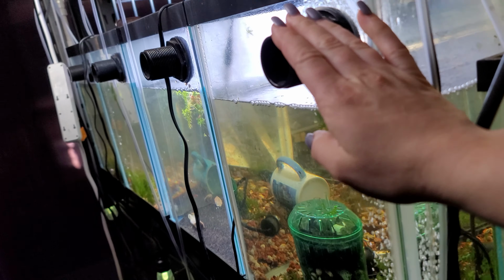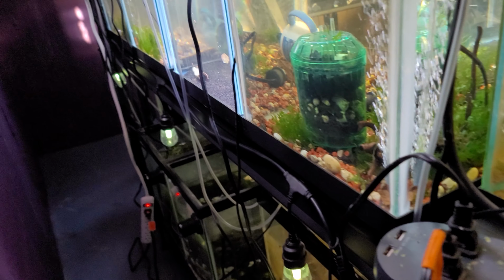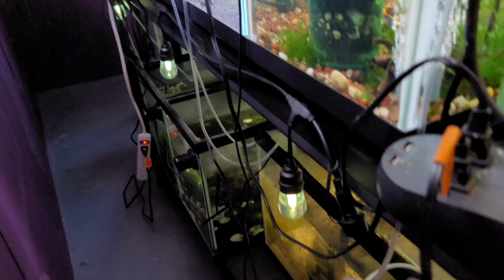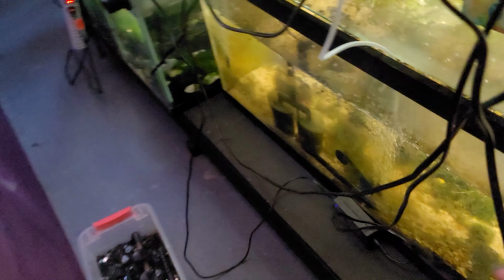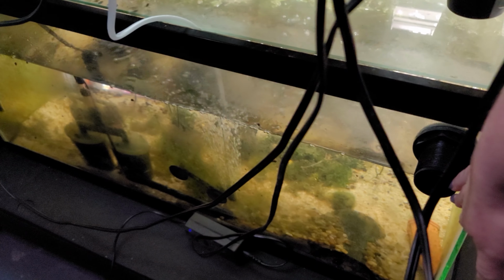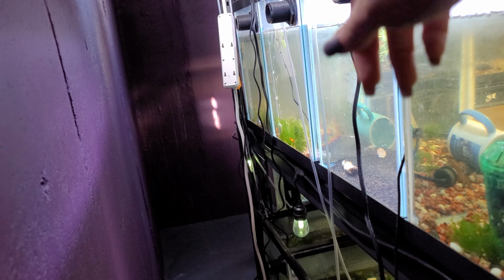Today I'm working on this part, the little elbow that comes out and then the drain part. We're going to have some water lines that come down, and then we're gonna have our gutters or drain pipes at each level. For the lowest tank, I might have to have a pipe right here. I might not be able to do it all the way down at the ground just because of the level of the drain over there. But it all has to be graded for gravity. So over there has to be taller than over here, just by a little bit, right?